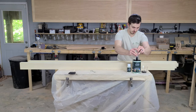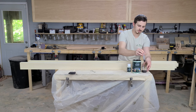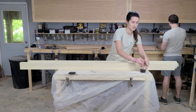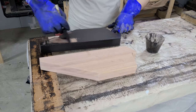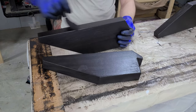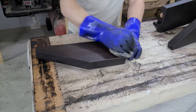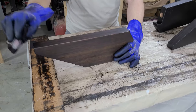The specific finish we're using for these pieces is Rubio Monocoat's Hybrid Wood Protector. We prefer a dark wood look so we opted for their black color. We love the way this color turned out on our modern bed frame build, though the color does turn out quite a bit darker when using the wood protector. Since this piece will be heavily touched, we added 10% hardener to the finish and mixed it up. Then it's just a matter of brushing it on. After 10 minutes we come back and brush over this piece again with a dry brush to spread around any excess finish and push it into the grain. Five minutes later and we are ready to buff off the excess. This stuff is much thicker than Rubio's Oil Plus 2C so our recommendation is to grab a rag and get to work.